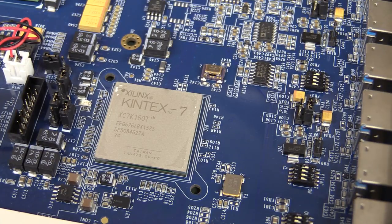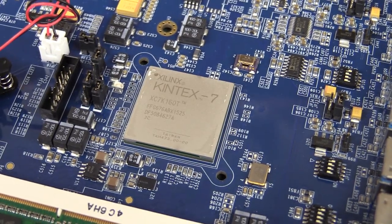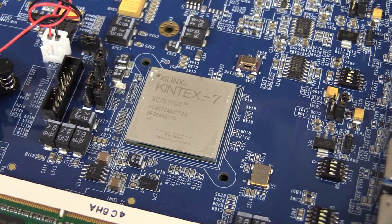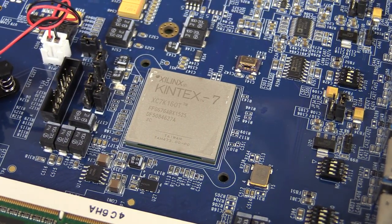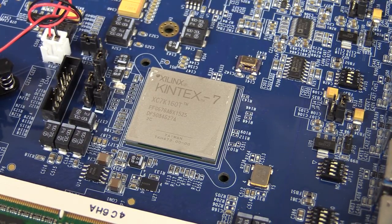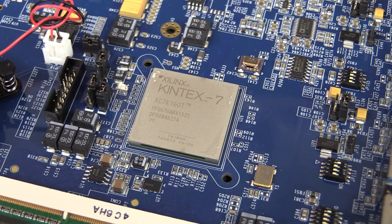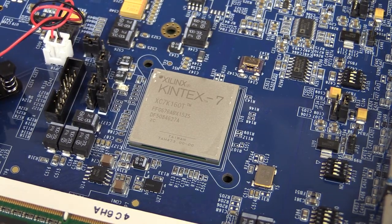All your serial decoding, you can do all that in hardware, because it's all running in parallel on an FPGA. So that's the beauty of that. And yeah, I would have been surprised to see a custom ASIC on this puppy, although I'm pretty much convinced that the one on the lower end, the Logic Cube that we saw, is a custom ASIC, which they did way, way back, because the company mentions stuff about designing their own chips for various products. That's in the company history part. But for something like this, you wouldn't. You just whack a Kintex in there and Bob's your uncle.